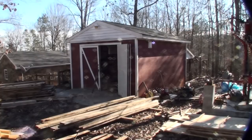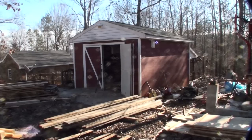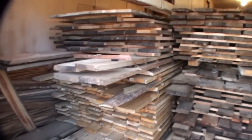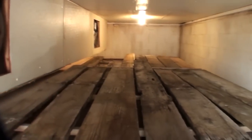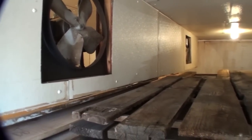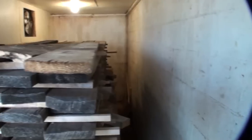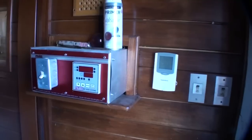Here's a shot of the kiln. It measures 15 feet long and 12 feet wide. It's cinder block construction with insulation underneath the concrete slab, mica chips poured into the walls, and then heavily insulated in the ceiling. Inside you can see all the boards piled up with that center divider — a baffle — which has fans mounted in it. That keeps air moving in a circular way throughout the kiln, flowing across and down the sides and pushing between the boards where they're all spaced out. This kiln is electric, basically a heat pump, with a control panel in a small side closet room.